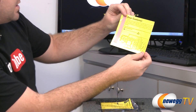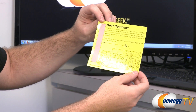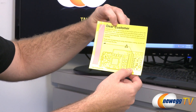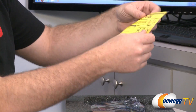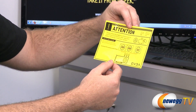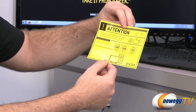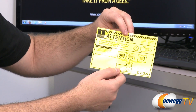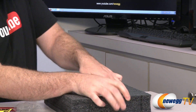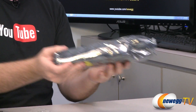First there's a note: 'Dear customer, thank you for purchasing the GTX 580 Classified. For those planning to use aftermarket cooling, we've included a non-conductive film for you to apply on your aftermarket heatsink — this will help prevent any possible shorting.' So they've given you caps and the non-conductive film for if you're going to remove the custom EVGA heatsink and put on your own, for example water cooling or a custom cooler. Also note: please allow the graphics card to cool for a minimum of two minutes after operation. And importantly, do not use the CPU 8-pin connector on this card — those both have eight pins, but they are keyed differently, so don't try to force an ATX power connector into this video card.